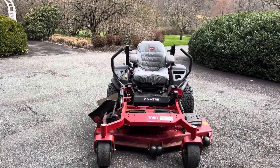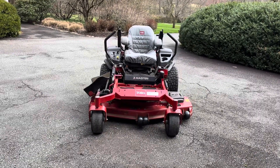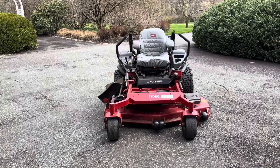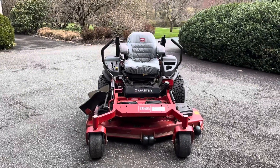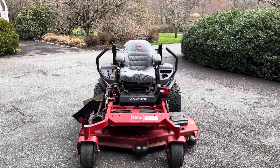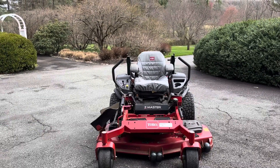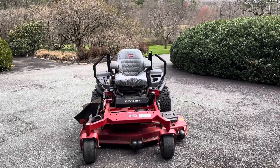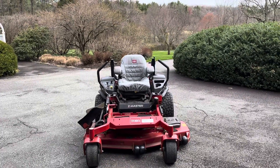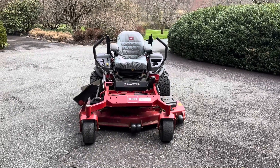That's why deck level and rake are so essential to quality of cut. The rake and deck level effectively change the height of the deck's baffle edge to the ground, which affects how much air gets in. You want the same amount of air coming across the whole rear and whole sides of the deck. You don't want any air coming in or out of the front — only grass should enter the front of the deck. The best way to achieve that is with a level mower deck and the proper amount of rake.